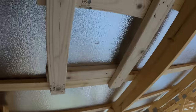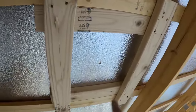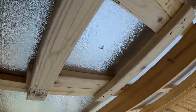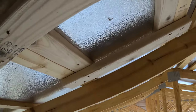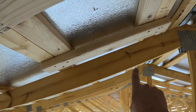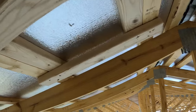come apart. So up underneath the roof here where the chimney's gonna go through, I went ahead and framed that out so that it has at least a couple inches of clearance on each side of the chimney pipe. So that is clearance horizontally. It's at least 12 inches this direction. This direction is closer to 13 and a half. So you gotta keep that in mind.